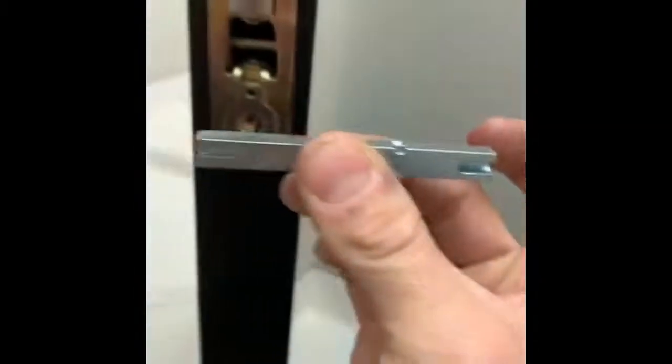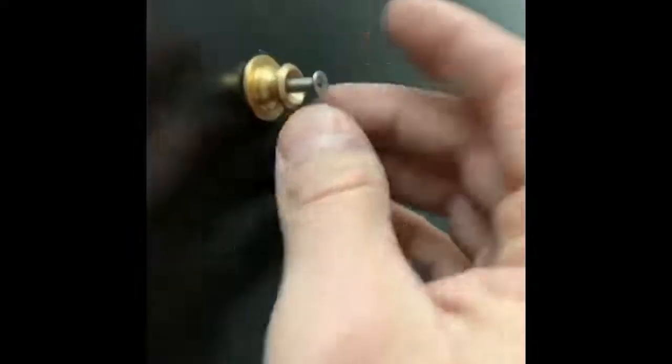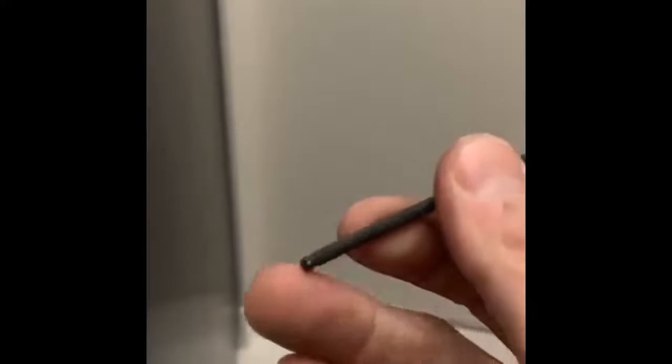So you can do it after the fact. Yes. So here's your split spindle, so that your levers operate independently, and these are stake punched — so you want to put that on the side that you don't want anybody else to pull through to enter the door. This gets put on with a spindle, screwed into those little adapters. The other side goes into this hole, which locks into the end. They actually give you a ball wrench. Now that these are on, do your set screws — torque those in. There are two set screws under here. That one is not for the plate — don't do what I just did. That's to level out your handle. Then these go on afterwards and get locked into those brass fittings from before.